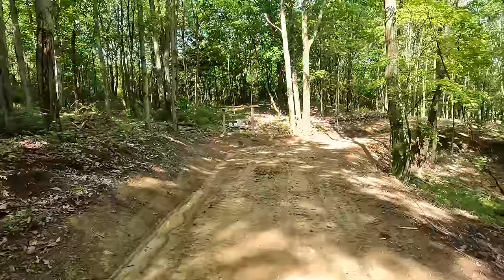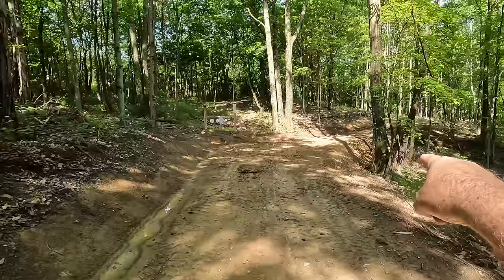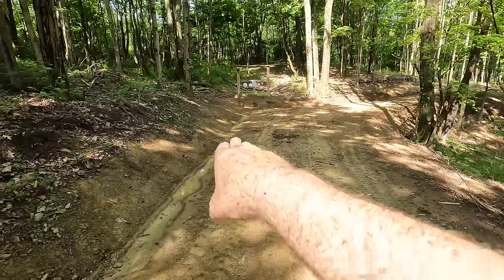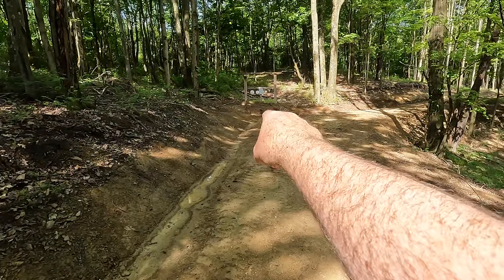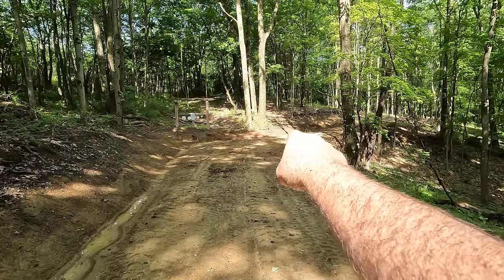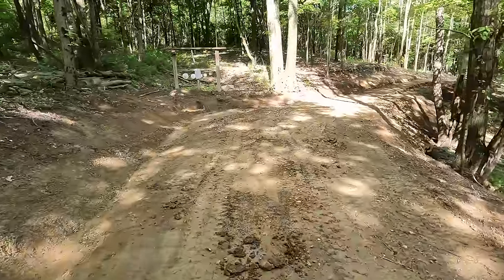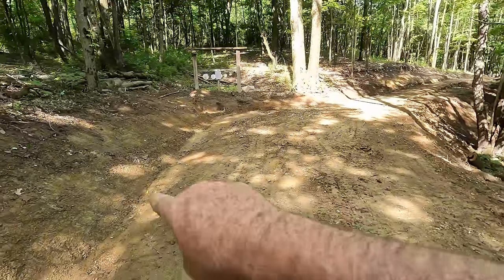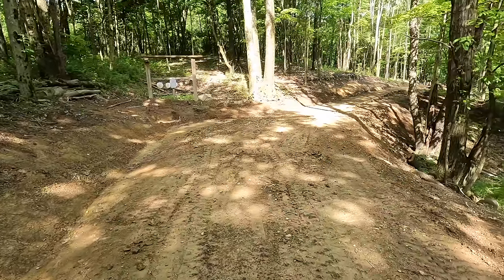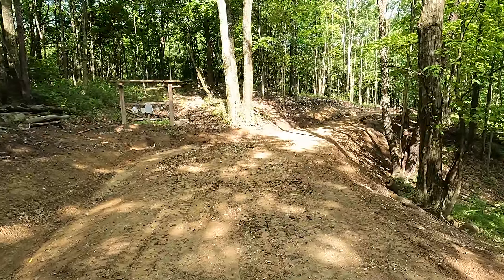I wanted my low spot to be in that corner right there where it's real wide, and then I'll run a culvert pipe across the road. So I've got a slight downhill coming this direction, slight downhill going that direction, and I wanted that to be my low spot, but it appears that it's right over there, okay? So we're gonna check that first, and if I'm correct, we need to fix that. It's kind of tough because it's real flat through here, and you wanna make sure you have fall going to the pipe coming from both directions. And like I said, just eyeballing it, it looks like that may be the low spot. I don't know, it could be deceiving, but we're gonna find out right now.